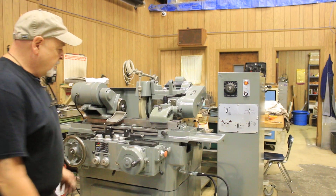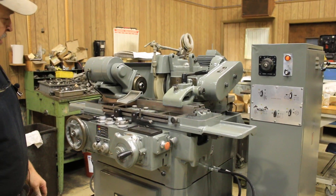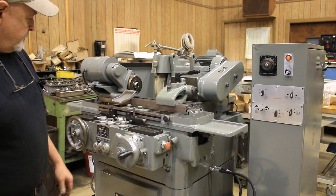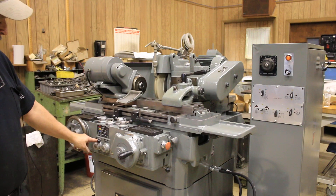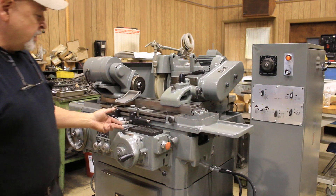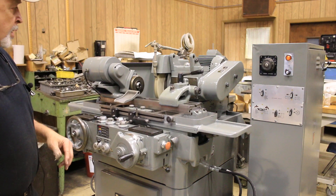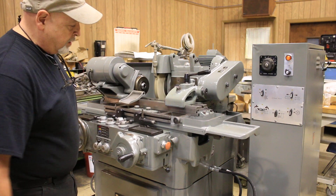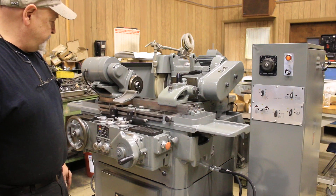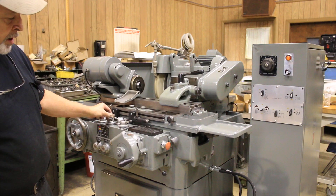So now this is fed in, and once I engage the feed you're going to start to feed down whatever side I select. Let's say we want the tailstock side. It's going to feed on the headstock side this way — there's a little picture here, I just can't see it too clearly. So now it feeds, and this is going to feed down to what you've got set as zero — you figured this out manually first. Now you're going to do it automatically, though you could do this all by hand. I would recommend that for the first few parts. I'm just going to speed it along a little bit here.